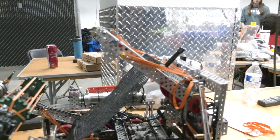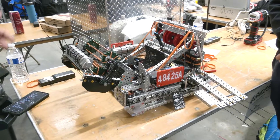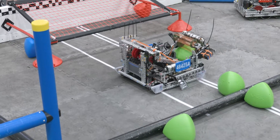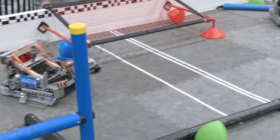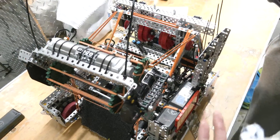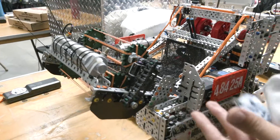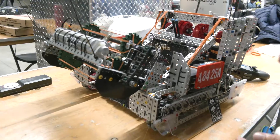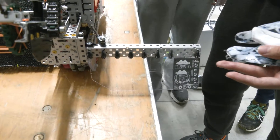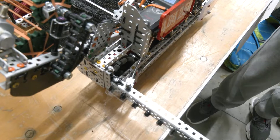Charles, let's talk about the foldable intake and the angled wings. Packaging is so important — what's gone into it? At the start of the match, this intake arm can be folded in to reduce the length of the bot, and rubber bands keep it held in. It'll pop out when the match starts. It's really simple but keeps the box compact when needed and extended when we need to use the intake. We also have angled wings on both sides that help move the tri-balls easier across the barriers, pushing the balls upward and forward at the same time.